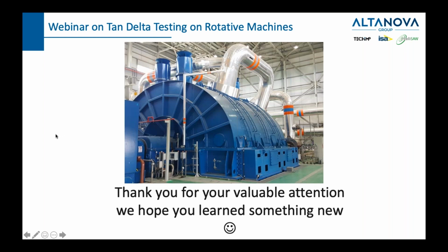Hello, I have two questions. What is an acceptable value of tan delta for global impregnation machineries? There is not one number, but we're always talking about values between 0.5 and 5%, depending on the type of your insulation and also the type of asset.